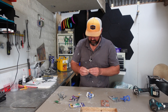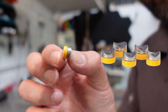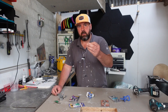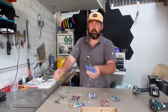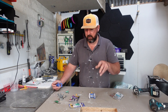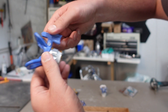You may be wondering what that little thing in the box is - that's a seat. I've got a couple of spare ones here. It's a little rubber gasket that goes in the back. Some of the Graco ones come with a little yellowy one - that goes on the back and is for harsher materials, so when you're cleaning it's not going to degrade the rubber because that one's plastic. You'd swap over to the yellow one when you're doing things like lacquers, where when you come to clean it they're not going to degrade the rubber. This is mainly the Graco ones you have to worry about - with Tritec they use the same seat for fine finish and standard. It's only Graco that uses a different seat with the standard blue ones versus the green and yellow ones. So if you're swapping between the two, you need to swap your seat.